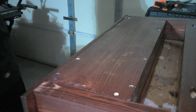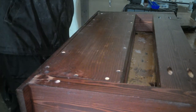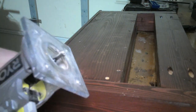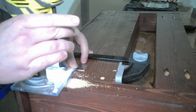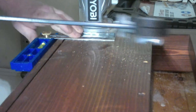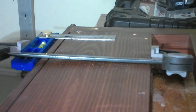The final thing we're going to do to this cabinet is set up some T-slots. T-slots are going to allow us to mount this cabinet to surfaces, walls, etc. They're incredibly easy to make and work very well. The most important thing is to make sure you mark out everything — the distances, the depths — make sure they're the same on both sides, otherwise you're going to have an uneven cabinet. When using your router, make sure you have a straight edge to guide it because your router can sometimes lose control.